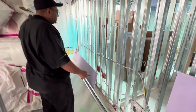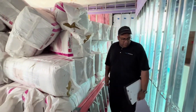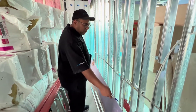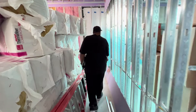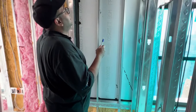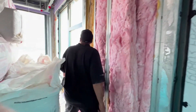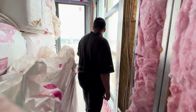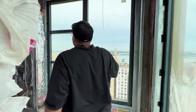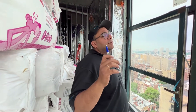This is the master bedroom — I'm assuming your bed is going to go here facing that way. I did a left and right and ran two Ethernets so you can do data or telecom — one side here, one side there. This was supposed to be a window I was calling out as a shade, but they closed it up so I didn't run anything here. The low-voltage plug-in is right here and right here. Shade wire here, shade wire there.